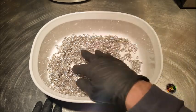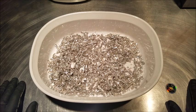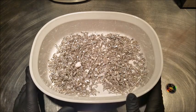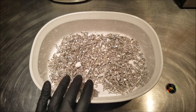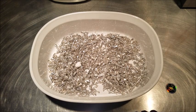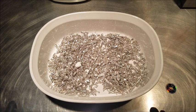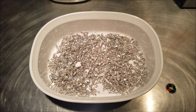But the last electrolyte that we used was pretty clean. It was a real fast batch. So we'll set up with that again. You'll notice it has some color to it. And after we run this material through the silver cell once with that old reused electrolyte, we're going to mix a fresh batch of electrolyte and then run the batch through another time. And if all is well, then after we run it through the second time, our clear solution should pretty much remain clear, if the first pass did its job. So let me go get set up and we'll get to it.